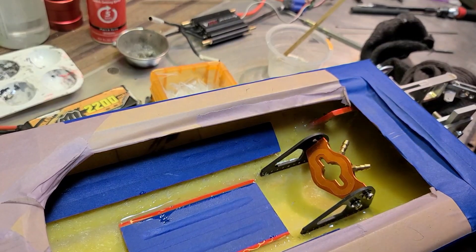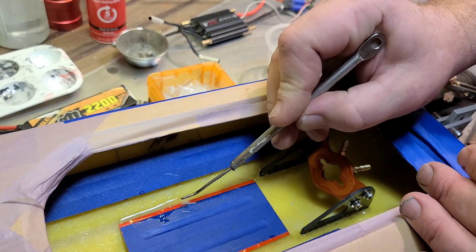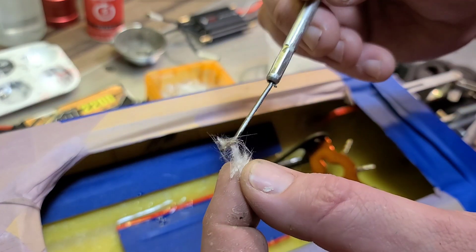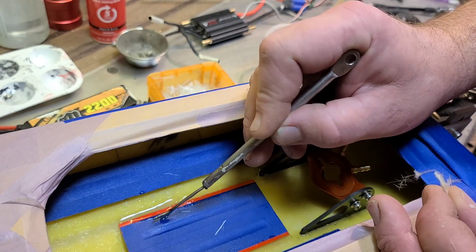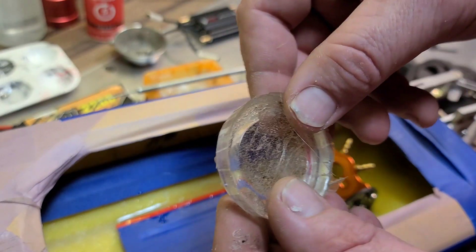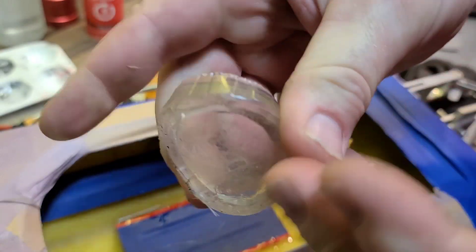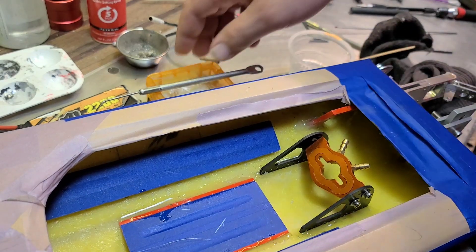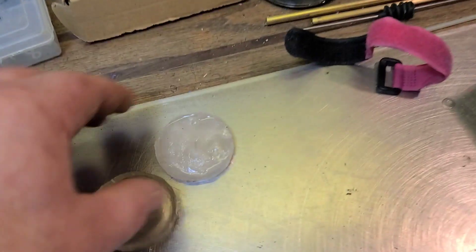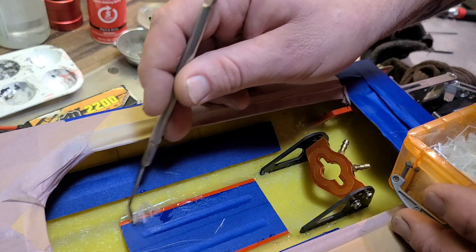Let's get some on the outside of this mount and start laying down some of that fiberglass cloth. Just take some of these little fiberglass hairs and mix them in with the epoxy that's already set out. You want to get the hairs on both work pieces — on the ESC mount and the bottom of the hull — that's going to reinforce it. I've got an example right here of epoxy that hadn't been reinforced; this is 24-hour and it's cured out for about two weeks now. Look how flimsy it is — it has no rigidity, no structure. Once you add these hairs to the mix it doesn't bend. This is where you get your structure and strength from — it really does make a huge difference in the outcome of your work piece.